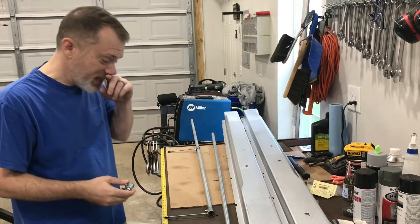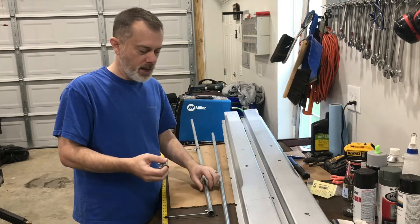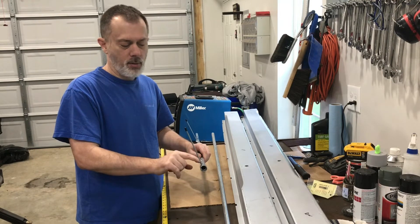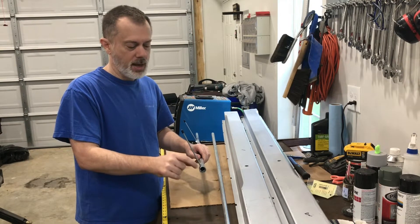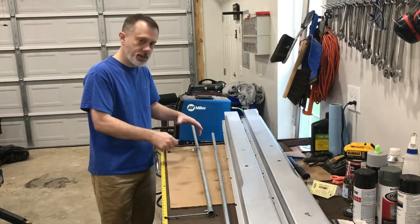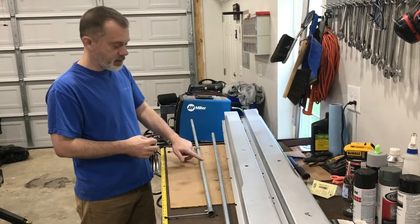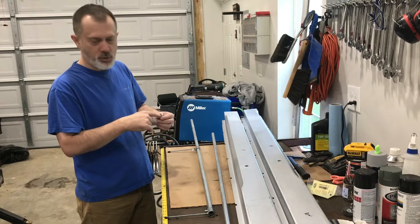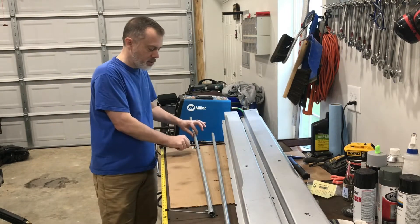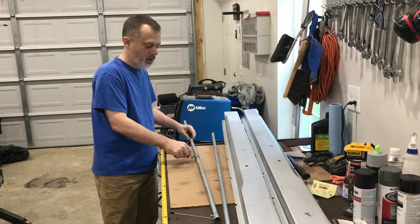In this instance, I need one of these connectors just so I don't have to worry about coming off the end — that's going to be my fixed point for my gauge. I take this one, slide it on, and run the screw until it's tight. Then for the movable one, all you do is take a drill bit that's the same size as the conduit and just punch that out. You can drill through this stuff so easily, it's really soft. Now this becomes a movable dimension you can set wherever you want.